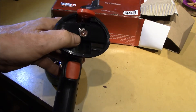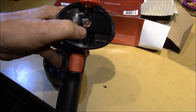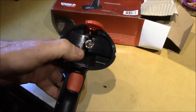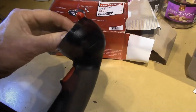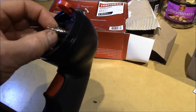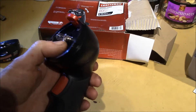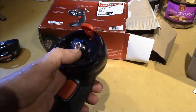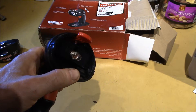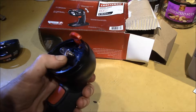I've found an LED flashlight bulb that's internally regulated - it has an internal driver. I was thinking that would be a really nice setup, but I needed to get the work light first to see if it was the right bulb. It appears to be a regular bulb - I think they call that a PR2 base - and if so, I've located a 1-watt LED bulb that runs from 7 to 26 volts.